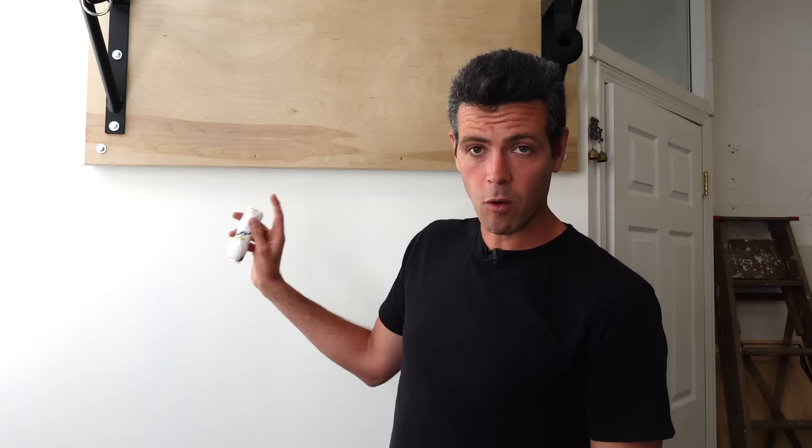It's not just one coat — it's spot priming and one final coat. I was using the same wall paint that's already on the wall so I was able to get pretty good results. Also, if you think you're going to be able to color match paint and touch up areas, you won't — you're going to have to paint corner to corner, your whole wall. Maybe one day someone will figure out a paint that doesn't flash and can be touched up even weeks later. Anyway, I hope this helps you figure out how to touch up those small little areas that are bothering you once you've finished your project and you just have a few things to fix but don't want to repaint the whole place. These methods are ideal for that situation.